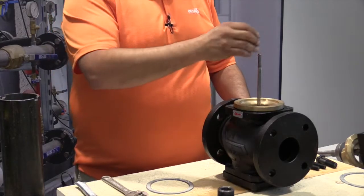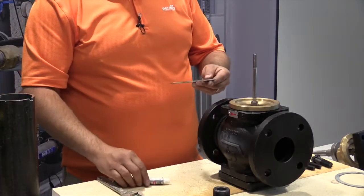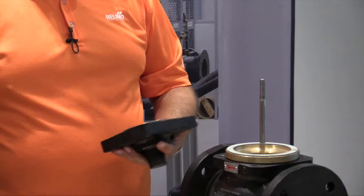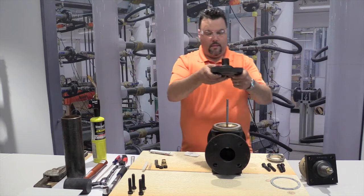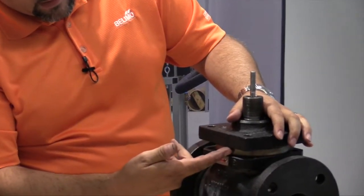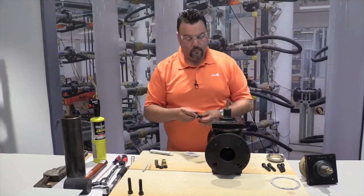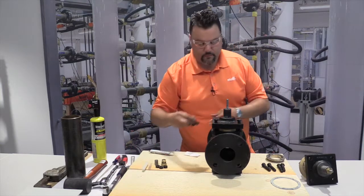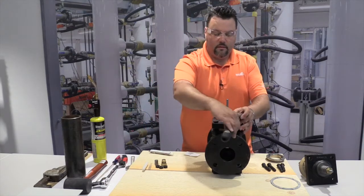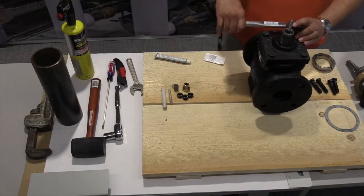Your next step is to take the end stop and slide that down over the stem. Grab your second gasket, apply a thin layer of sealant, and put that on top. Then take your top plate — again, some sealant — and the top mounting flange down over the valve. It's important to note, before you close this up, that we have two gaskets: one below the chamber and one above the chamber. From here, put in your new bolts and then torque the bolts. The torque wrench is preset to 20 newton meters. You want to tighten this down in a star formation or crisscross.